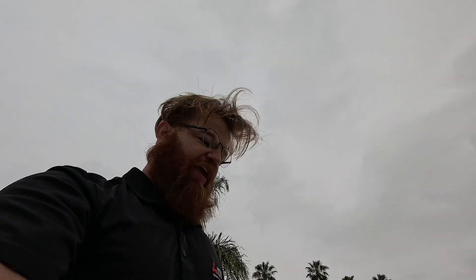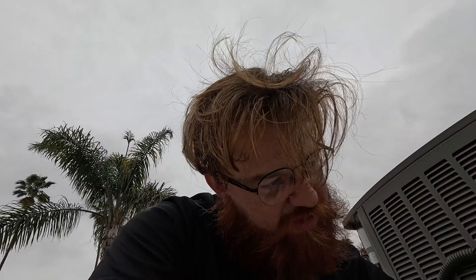I'm going to say this was a successful attempt with this leak sealant. But this isn't typical — I tell everyone to expect it to leak back out, expect it to be a gamble. This homeowner got lucky. I told them to anticipate us coming back out for a leak repair or leak search. There's no evidence of oil. Checking joints, the evap coil, and the inside of the condenser coil — no hard evidence of a leak. Looks like the leak sealant worked.